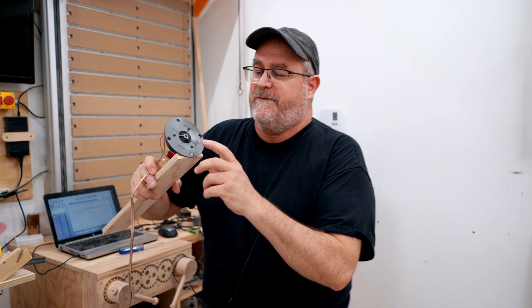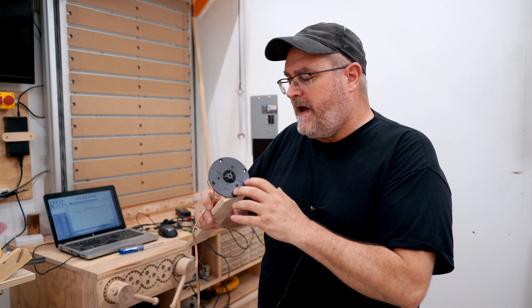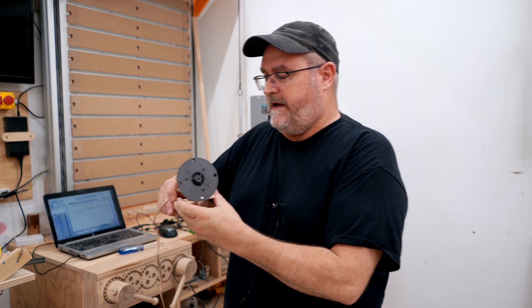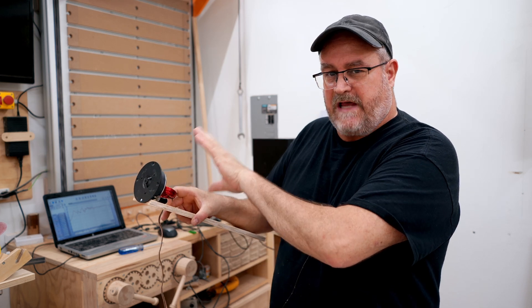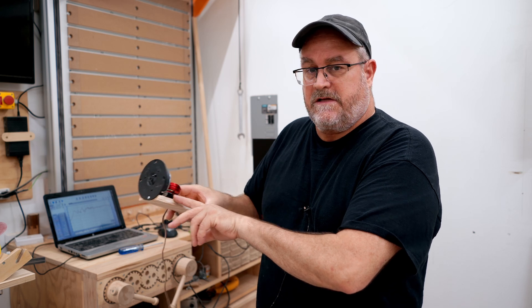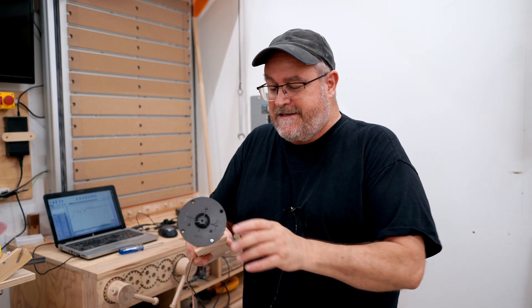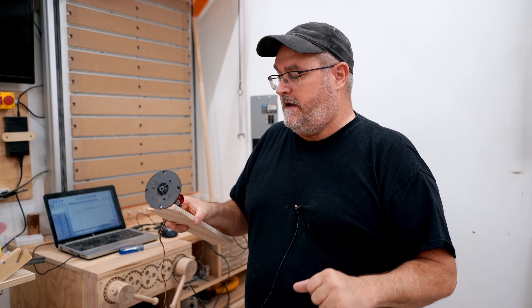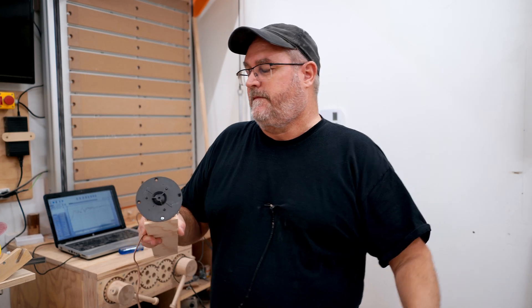It's just a piece of half-inch plywood with a regular tweeter mounted on it — it doesn't have to be any special tweeter. It's facing forward. I have a coil on it now, but that was added after. The original was just a single capacitor, 2.4 microfarads, which is a first-order filter at around 8K. So everything below 8K is sloping down.